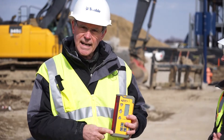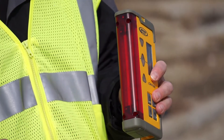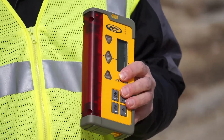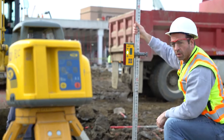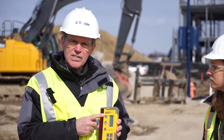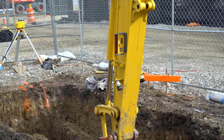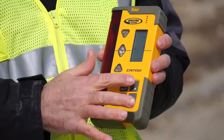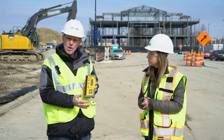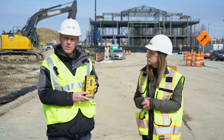Moving to the outside, you can see that it has a very long laser reception window. In addition, it's over 180 degrees so that it's always going to be easy to find the laser. The LEDs are super bright and you can see them in any lighting conditions, even in the brightest sunlight. We have three buttons for your most used functions, adjusting dead band or accuracy zone, the brightness, or the value.